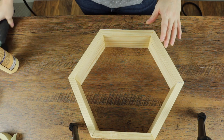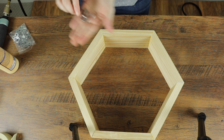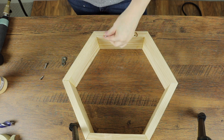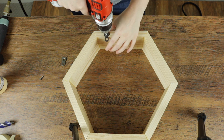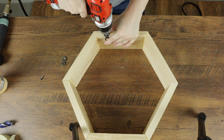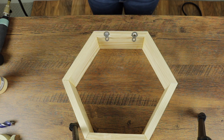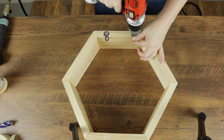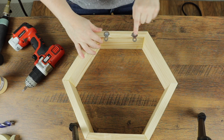Once the box is dry, place your hangers along one side. The hangers I use are actually figure-eight table fasteners — I'll leave a link in the description below if you want to use them. To install them, I countersunk the locations with a three-quarter inch bit, pre-drilled screw holes, and then attached them using a one-inch wood screw. You can turn these so that they hang either inside or outside of the box. To mount them to your wall, all you need to do is place your wall screws through the other opening of the figure-eight fasteners.